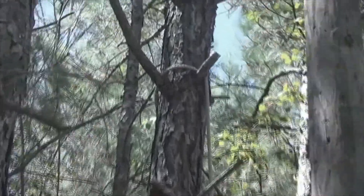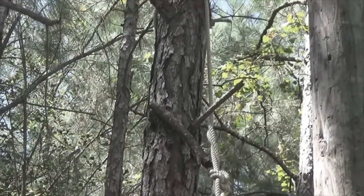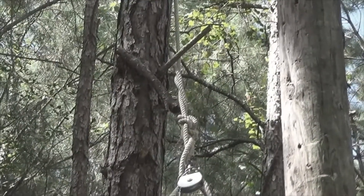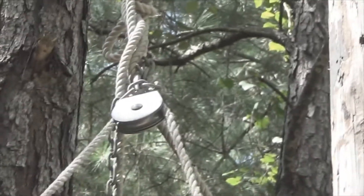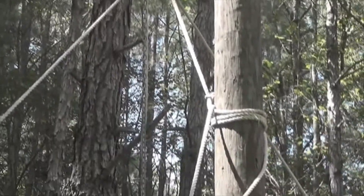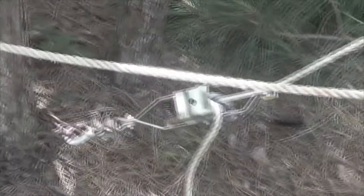I haven't even bought the parts yet. What I did was, using the throw ball, I set a rope up here. That rope is variable — I could have pulled it up higher. I just left it where it is right now because that would work for me. I came down and I used a bowline and a piece of chain to hook that. That's my snatch block right there. Then I put my continuous rope puller rope tied approximately halfway onto the pole, and it comes back down and goes to my rope puller.